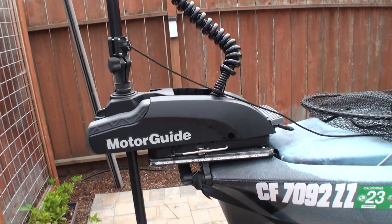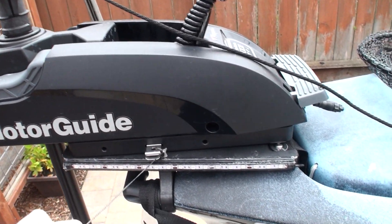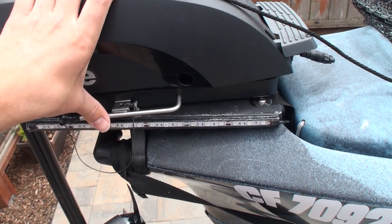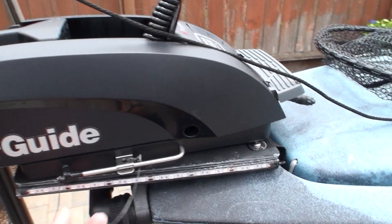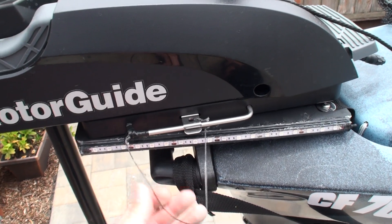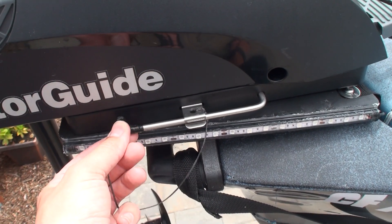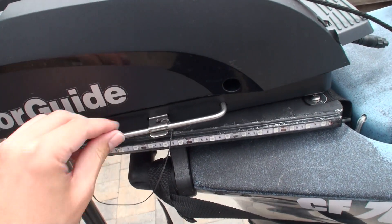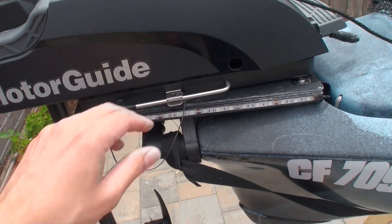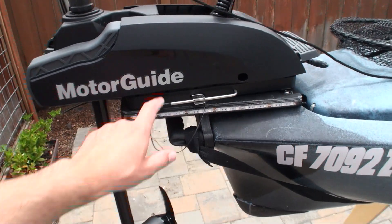The XI3 is mounted on the One Objective and has a quick release bracket that you get from MotorGuide. It sits on top of the One Objective mount — you slide the bracket in and it snaps in and you're good to go. One little tip: I did add a tether using some paracord, tied it off to the bracket and around the actual motor as well. That way you don't have to worry if it falls out, because if the bracket's not installed the trolling motor will just be moving all over the place.